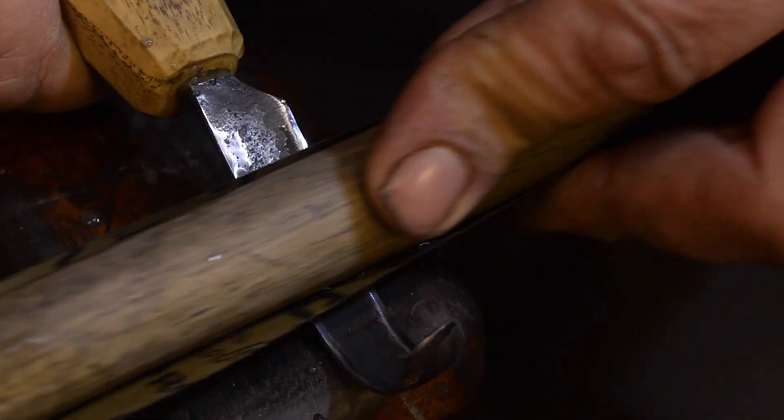Something I've noticed is you're holding the knife differently than I would — I'm right-handed. Because I do this professionally, most of my time is spent doing right-handed blades, so as a left-hander you're seeing a left-hander sharpening a right-handed blade, which is perhaps a bit easier because I'm pulling away. If I'm doing a left-handed blade, what you can't do is push — I've still got to work away from the edge on this side. If you push away from the edge that won't work as well because the paper wrinkles up. You need to hold the paper in tension, pulling away from the edge. If you hold it this way you can work away from the edge and keep the paper in tension.